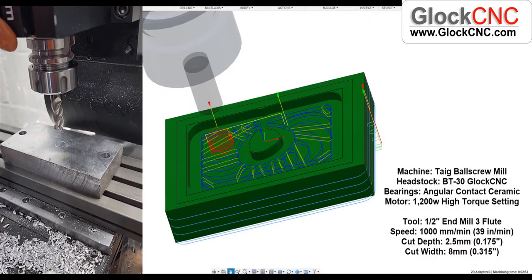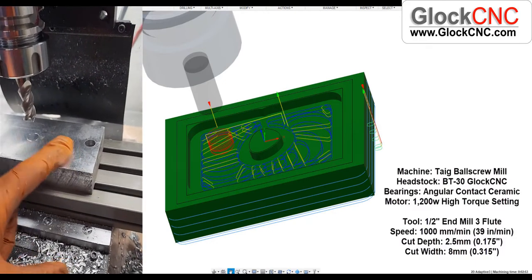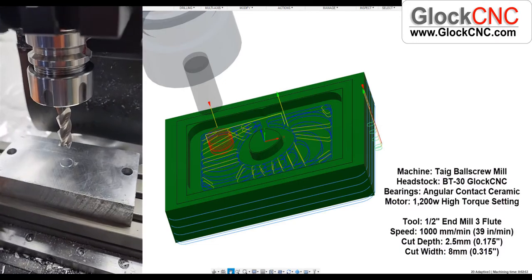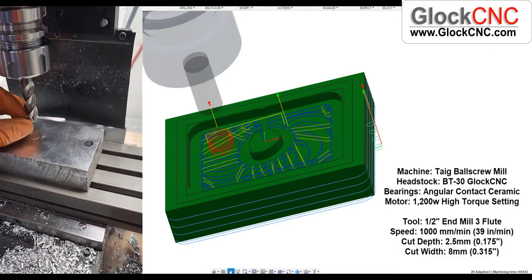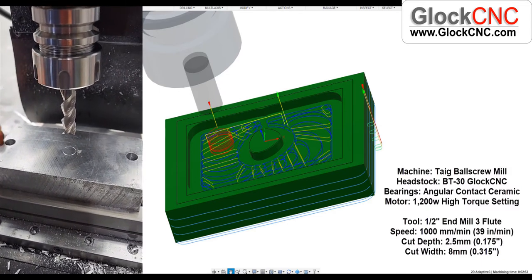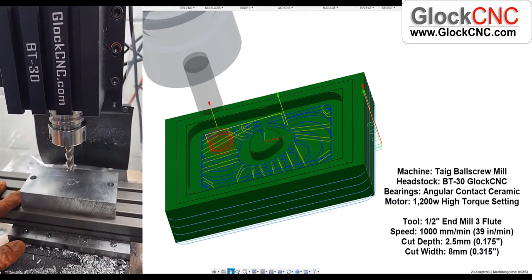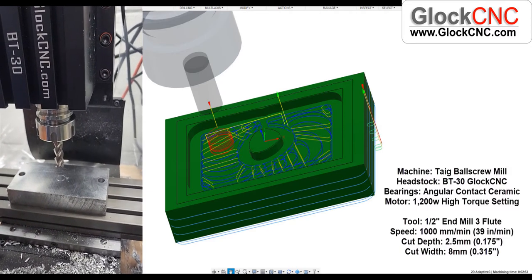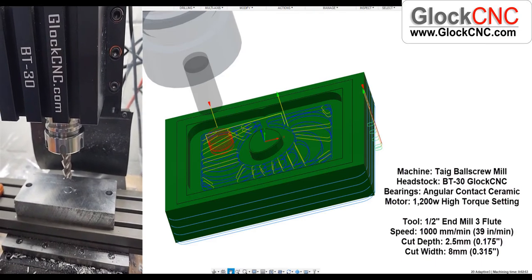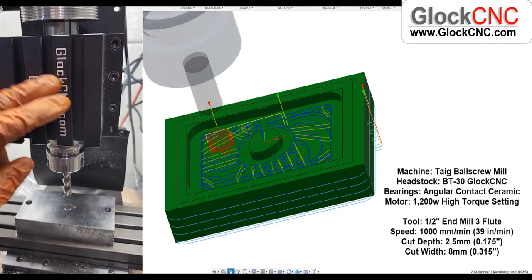In this next segment, we're going to put a pocket in here — I believe it's 50mm by 80mm — and there's a feature in the middle that's kind of a kidney bean shape. Plunging in and doing that kind of work, especially with a half-inch cutter, can be taxing on a small machine, but I wanted to do this to see what the limits are. I'm not recommending these feeds and speeds — just for fun. It does illustrate how rigid this setup is, especially that dual stack of bearings and how far up the tooling goes into them.